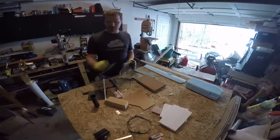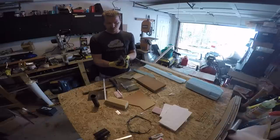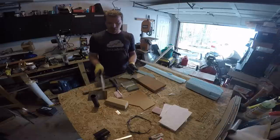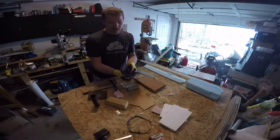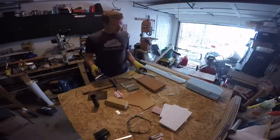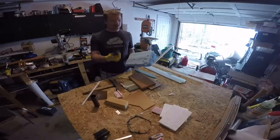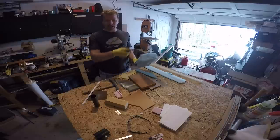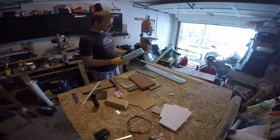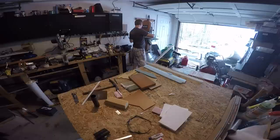Actually it's a negative kerf because the thickness of the blade is wider than the cutting edge. A hacksaw actually has a kerf — it has a set to the teeth — so it cuts a little channel for itself as it goes down. The reason I'm saying this: you can cut through thin pieces with a razor blade no problem, but start cutting through thick material and the blade starts really sticking. With a flexible blade it'll start wandering out of the cut. If you have a bandsaw, all of these materials cut very easily with no blade changes needed.